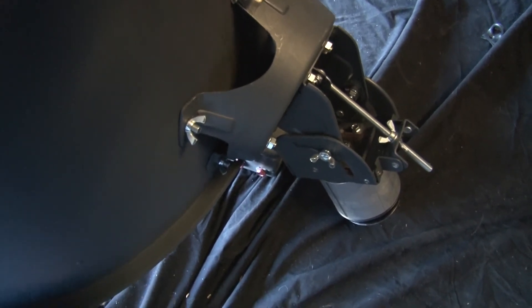Take the top wing nut. Unscrew that wing nut about three or four turns, but you've got to hold pressure on the satellite. Then the lower nut is right there behind it. In between that bracket on that shaft — say you want to raise it up a little. It's at 23, but you think, hey, if I go to 24, maybe it'll work. Hold the dish, unscrew that top one a little bit to give you some play, and then pull the satellite dish down to where it stops, then lock it with the wing nut on the right side. Once you get your elevation, you want to tighten those wing nuts up. They're numbered on the side: 30, 40, 50, 60.